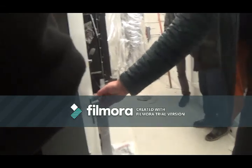So for him, he will do it from the transfer switch? Or no, this one, only the technician touches. The only thing you have to do is a visual: you make sure that this one is in the on position. A lot of times they might trip or something like that, and then we get the call sometimes from the customers. Can you actually lock this? It's not recommended to lock it, and the reason why is if something goes wrong in here, you want to be able to get to it.